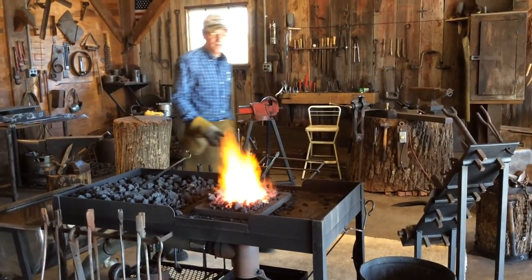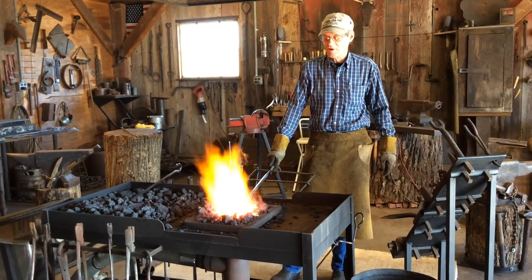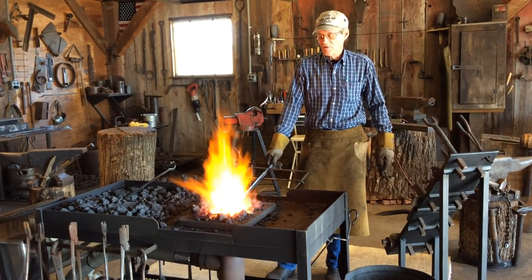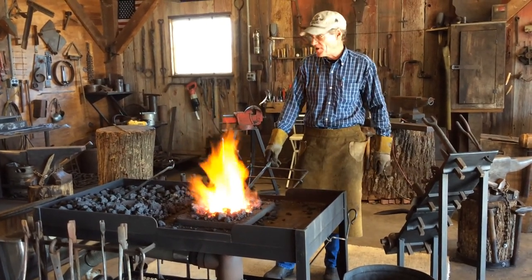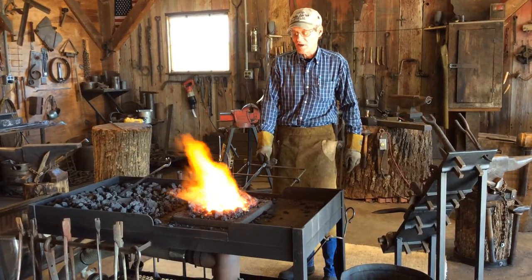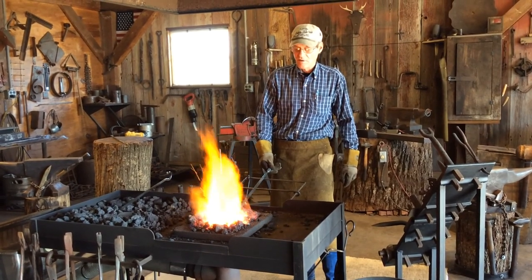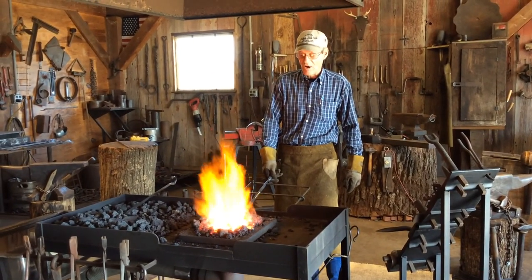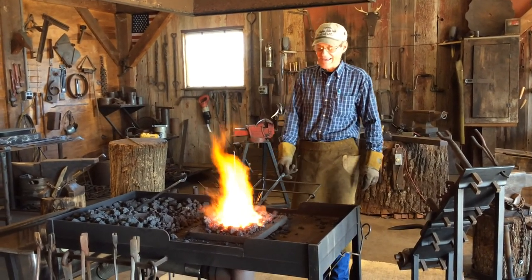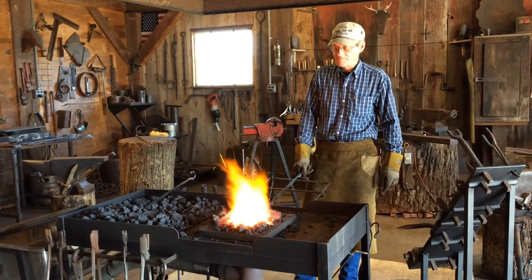Normally I don't make leaves on the power hammer, but in this particular instance, I've got to make 16 for a light fixture. So I just went ahead and swapped heads on my power hammer. I've got one for making leaves, and went ahead and put it on, and saves my elbow, because I have to finish them out by hand anyway, so that's just doing my dirty work.